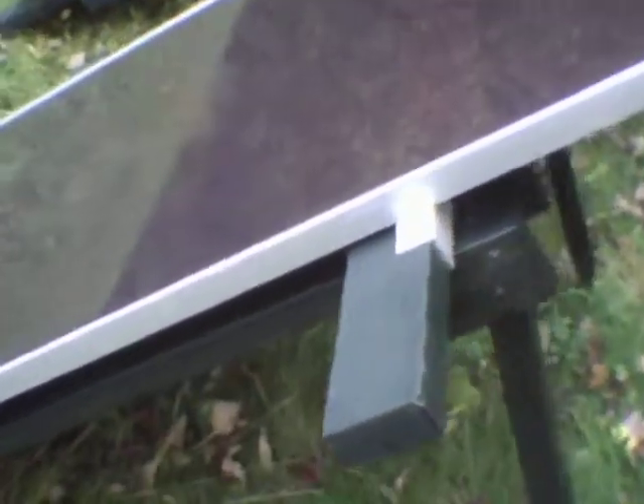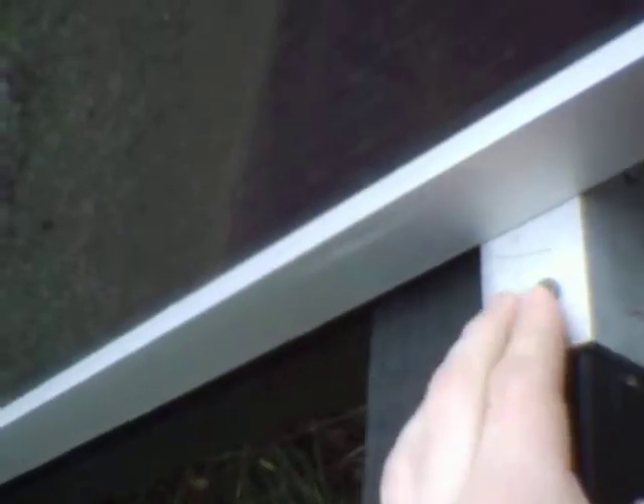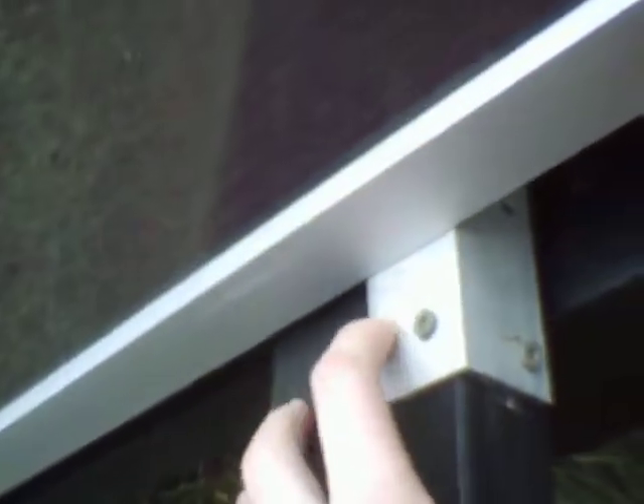This is just a little solar update. Got the frames for my big huge QS solar modules built — a little homemade, using 1.5 inch by 1.5 inch by 1/8 inch aluminum angle, held in place with epoxy coated screws.